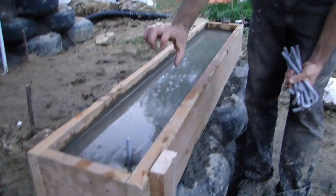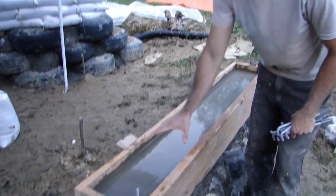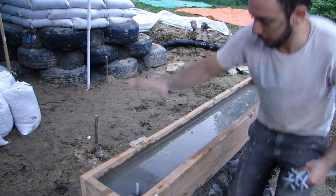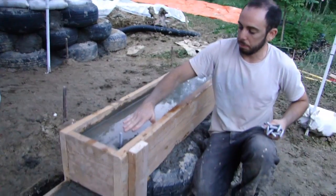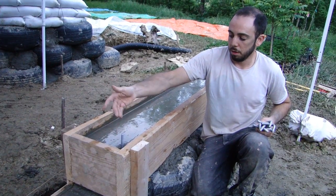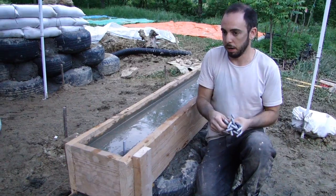The reason for that is because our 2x plating is an inch and a half tall — so maybe 2 inches sticking out. Think of it this way: you have a 2x plating with a hole drilled in it, set right on top of the concrete. You just want enough thread up here to screw down a bolt and a washer to hold that plating down. That's why it's sticking up this high.